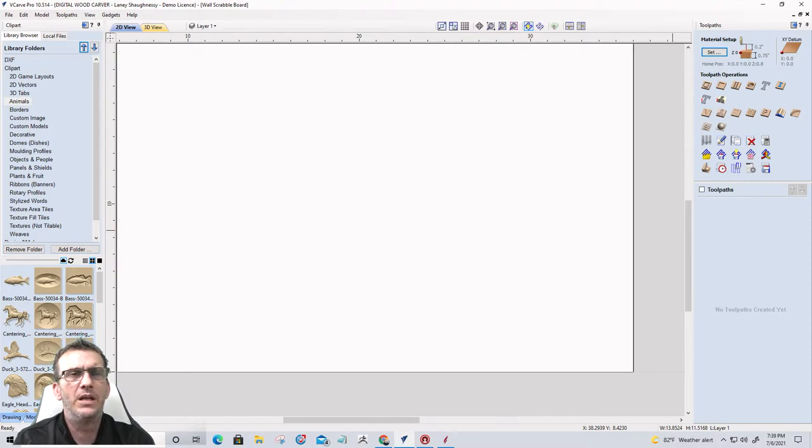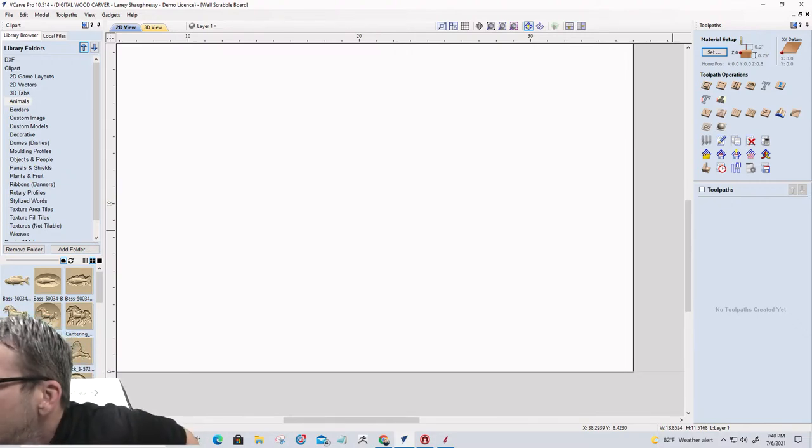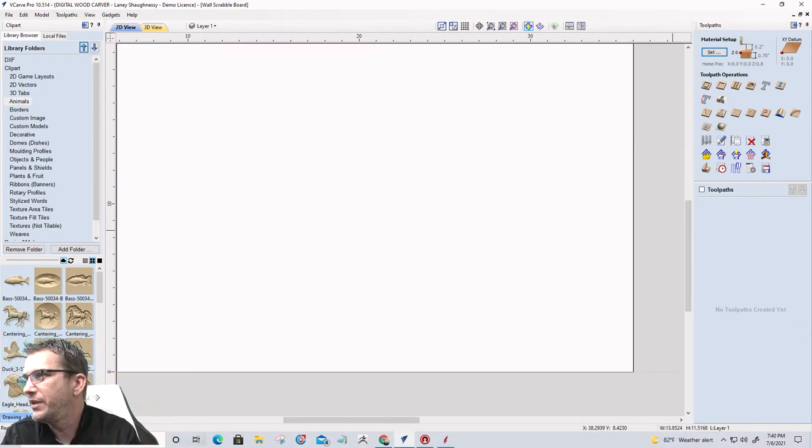I would say spin at 22,500 RPMs on a quarter inch two flute end mill. If I was using a quarter inch four flute bit, I'd be spinning that around 12,000 RPMs, because the gullets are much smaller. I'm going to recommend that if it's mostly woods and plastics, you use three flutes or less. If you're in non-ferrous metals, you can go up into four flute and five flute bits. So hopefully Kool-Aid, that helped you out a little bit.